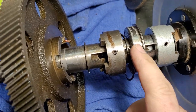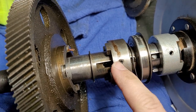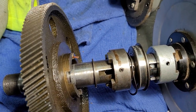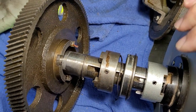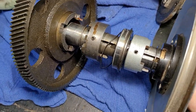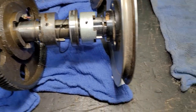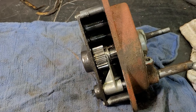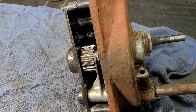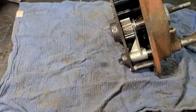The other issue I found with these is that these are roll pins, and this one was actually broken. I had to hammer it out and put a new one in because this one would not move at all — it was frozen. One was dirty and the other had a broken roll pin. So just be cautious: cleanliness is a little bit more important with the second generation. The first generation is more enclosed and leaves less exposed to the elements for contaminants to get in.